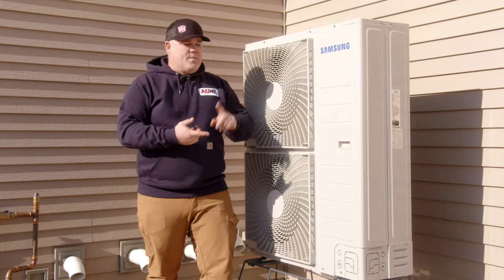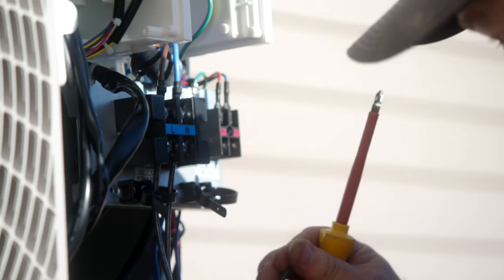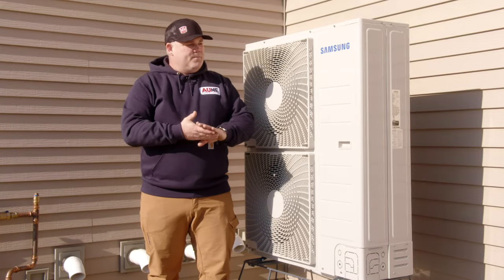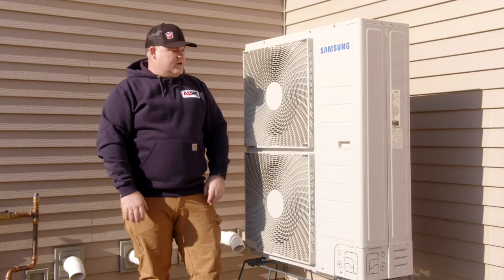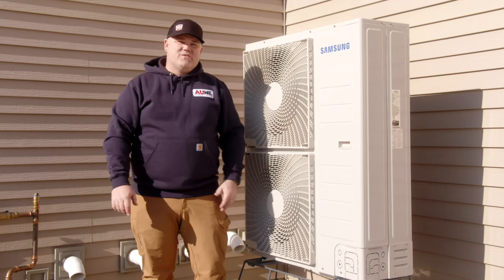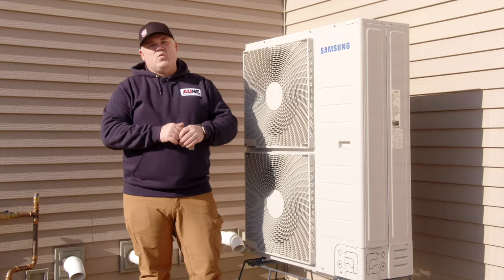Overall I'm impressed. The installation was super simple — standard line set, two-wire communication. The control is very simple, and it's a great drop-in replacement being it's a universal. This is an R410A system — a four-ton unit, perfect for my house here even in Minnesota, where our design temperature in the wintertime is 14 degrees below zero Fahrenheit. Check it out — Samsung Hilux. If you liked this video, please hit subscribe. I appreciate you watching. Have a good day.